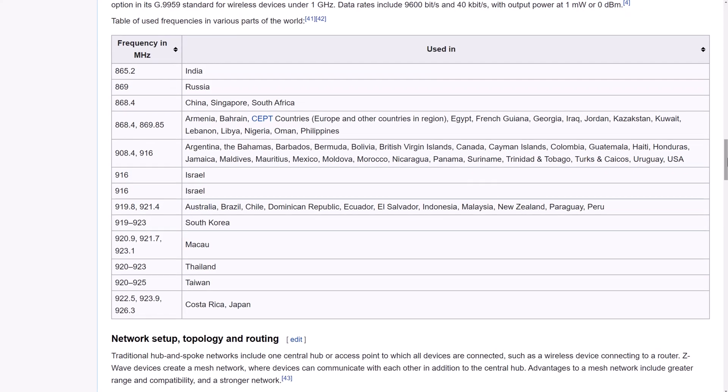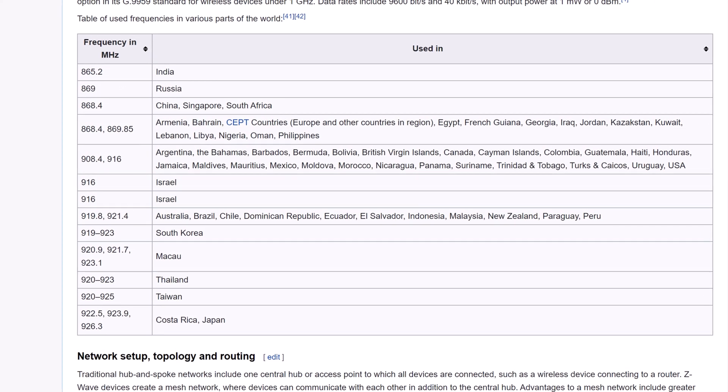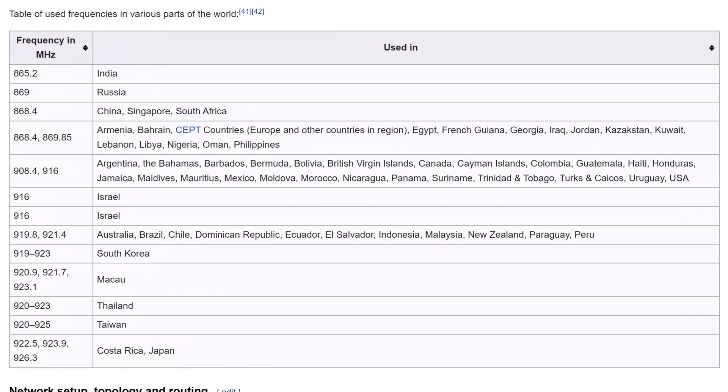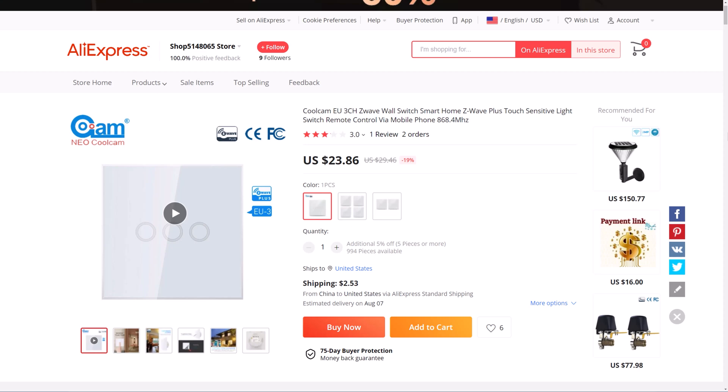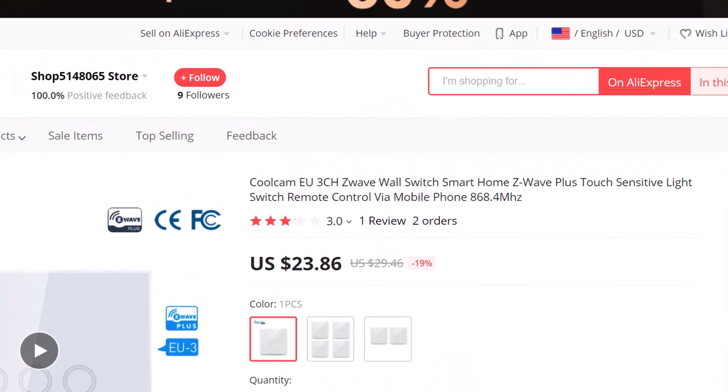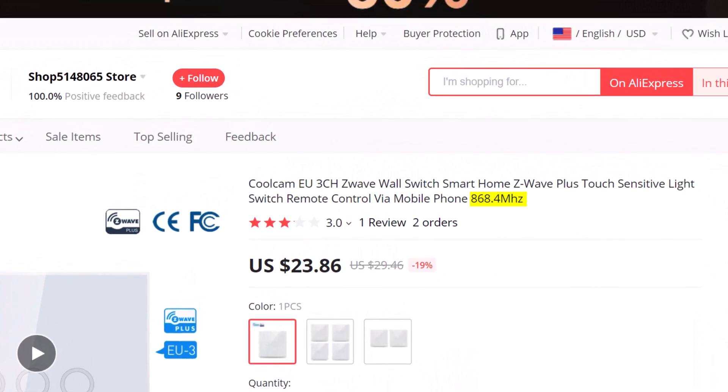These signals are sent on a wireless frequency of around 800 to 900 megahertz, but it does vary slightly country to country. That does mean it's super important that you buy a Z-Wave USB controller and devices that are designed for your country and region. If you're buying from a local supplier, you're not likely going to have any problems. But if you're buying devices off AliExpress or from other overseas retailers, make sure that you buy ones that work in the frequency that your region is certified for. If you run your Z-Wave network on a frequency other than what has been approved for use in your country, it may actually be illegal.